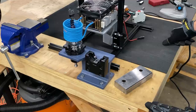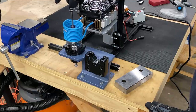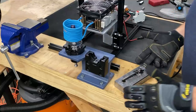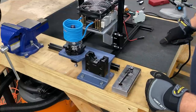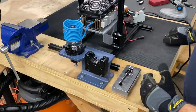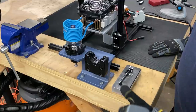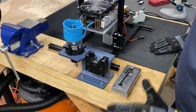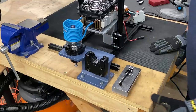I would think that's got to be getting close. There we go, guys — in, then out. That's a quarter-inch end mill, pretty long shank. I'm super pumped. I'm able to use shrink fit for some really high-clearance areas — that was my primary motivation, more than anything, just to get more clearance, less runout, longer tool life. Primarily clearance for the five-axis stuff, but I love the idea of lower runout, longer tool life, better surface finish. All right, that's that — see you guys in the next one. Bye-bye.